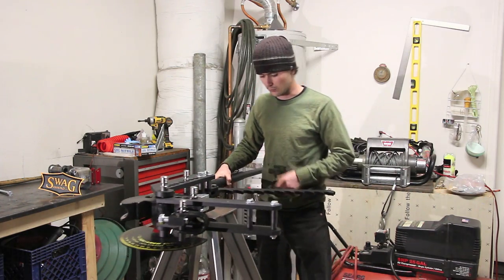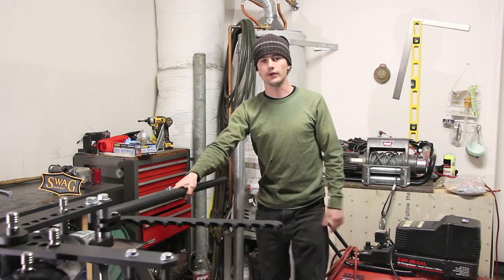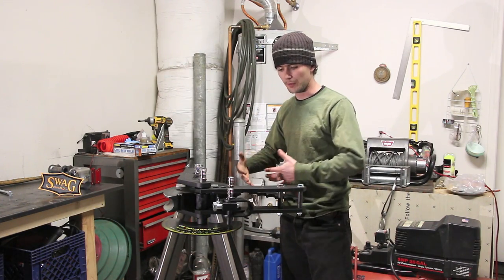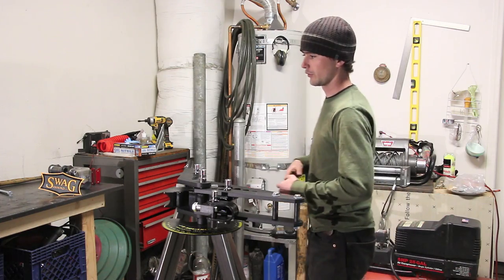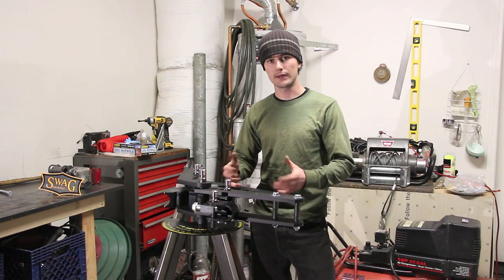So I made this stand with wheels on it, casters on the back — rolls great, very easy to move around. And with the hydraulic, I can sit here and run it, open this thing up, bend the tubing, and stand right here and watch my dial gauge very precisely. With the hydraulic assist, you can bend tubing more accurately and with less effort.